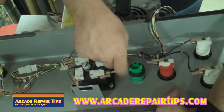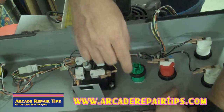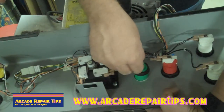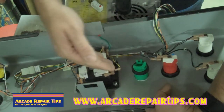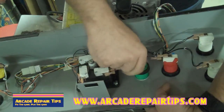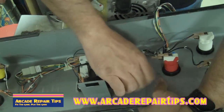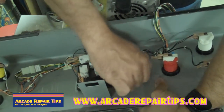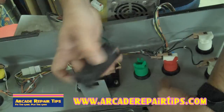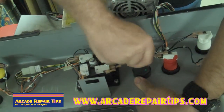Just a quick tip here: notice the position of this and how you want that button — or the wires — to come through. You don't want to turn it in such a way that it's hitting a bunch of other stuff. What I want to do is either go the same way as the existing button — I like things to be uniform and all the same way — or at least out of the way at an angle. I'll keep it the same way as the red one. Get this as tight as I can by hand, then take the button wrench, get the right size, and tighten it. That's as much as you need.